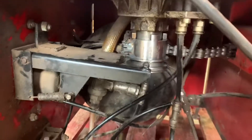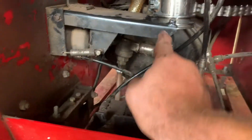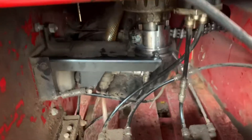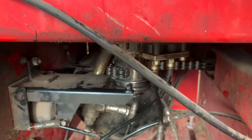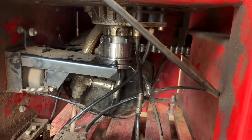When you pull the bead breaker arm out, it opens up that little valve right there. And when it does that, you push on this pedal — it puts air to this cylinder right here, which moves this shift fork thing up and then it locks in right there. And then it pulls on the chain. That's how it works right there. So as long as my duck-shit welds hold, we should be good.